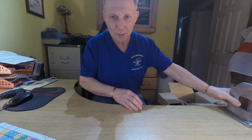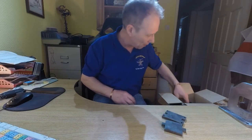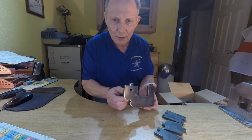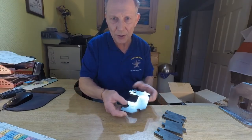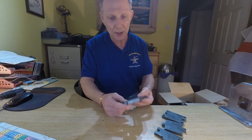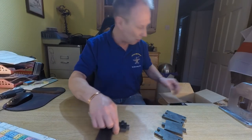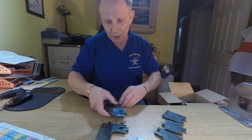So I went back and revised the drawings and came up with this. Now this is how it all came - the only thing I've done to this one, I've literally just run a sander over it to take any little burrs off, because you still do get some slag on these, not an awful lot with laser cutting depending on how good your laser cutter is. All I've done is taken any little bits of slag off just to make it nice and smooth. I haven't done any filing, not like I did on the other one.